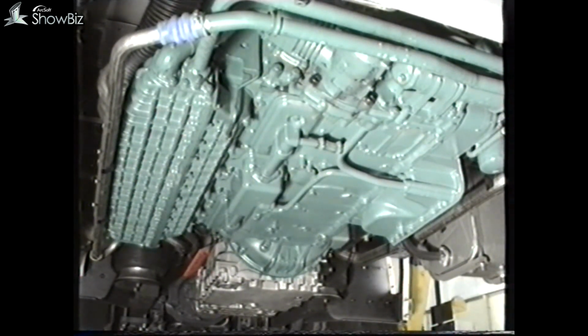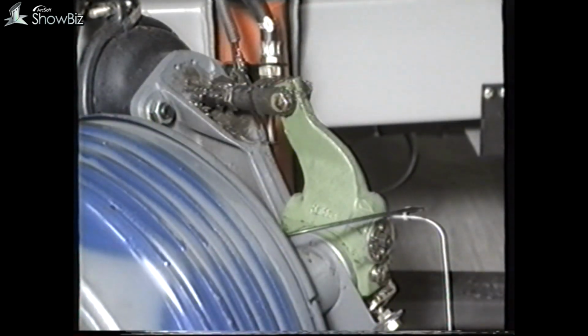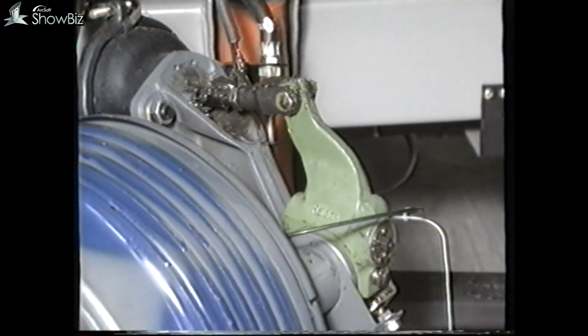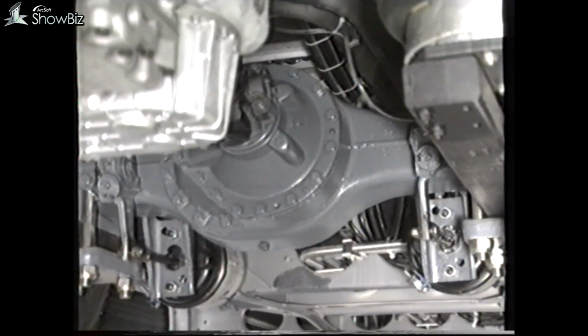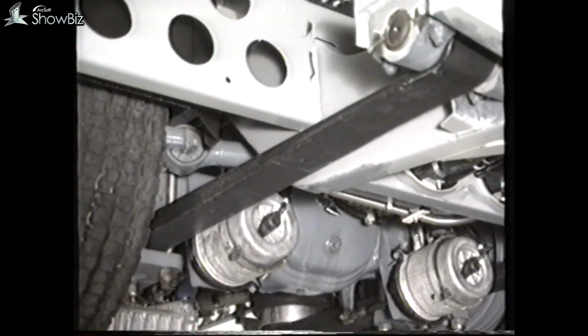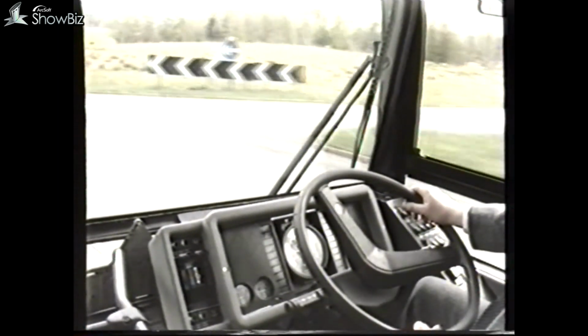To continue, the Lynx has a conventional beam-type axle. Direct air brakes are fitted with dual circuit to operate the front and rear brakes. Spring actuators on the rear provide a park brake facility. A taper leaf air suspension system is fitted to the Lynx on both front and rear axles. And finally, a fully integral power steering unit is fitted to give steering assistance.